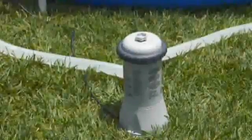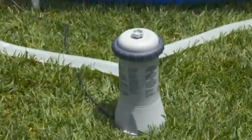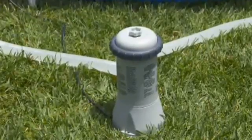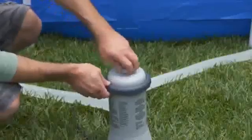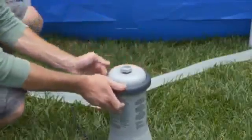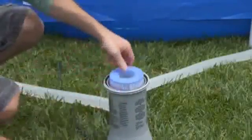The filter cartridge will clean effectively for about 2 weeks. At that time, check to see if it needs to be replaced. Before checking the filter, stop the flow of water through the system. Refer to the manual for replacing the inlet jet and strainer nozzle with the provided black hat-shaped plugs inside your pool. The plugs prevent water from overflowing when opening the pump's cover. Then open the air release valve, unscrew the housing collar, and remove the cover.